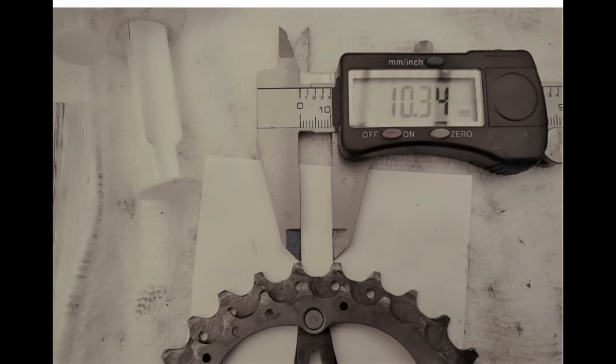Often on 11-speed, even running one chain to 0.5 percent, a Dura-Ace cassette is typically toast — you typically only get one cassette to a chain because those soft cogs simply wear. There's not enough data on SRAM Red versus Force and all that. We know more about Dura-Ace versus Ultegra. In the mountain bike world, SRAM Eagle cassettes have their smaller 11 cogs made of tool steel — extremely wear resistant — whereas the largest cog is made of alloy. People running that largest cog on X01 or XX1 cassettes often find when they put a new chain on they may need to throw away a magnificent and expensive cassette where 11 tool steel cogs are still in mint condition but one alloy cog is chewed out.